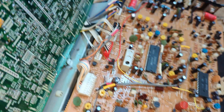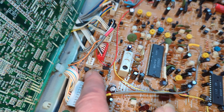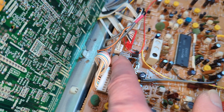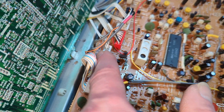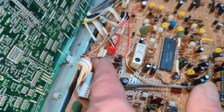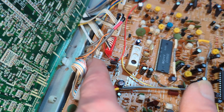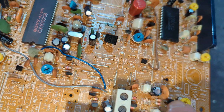Another thing as well, I don't know how I managed to do it, but I blew the semiconductor fuse. It's an N20 fuse. I had one on another board, so I just swapped that out. But the symptom when they pop, this is for the 9-volt switched power supply. I had turned it off, honest. I desoldered it stupidly, really. I desoldered it with wick.